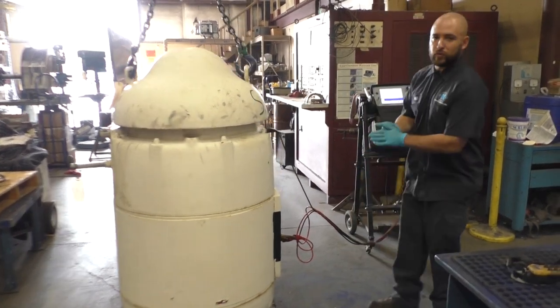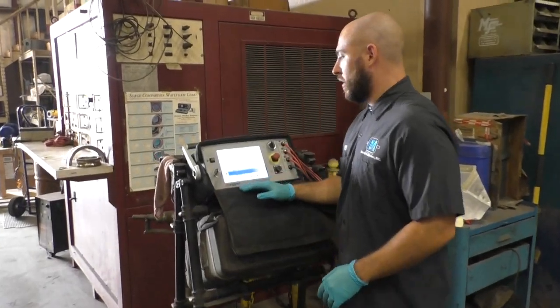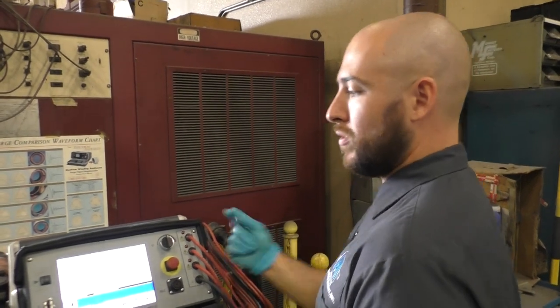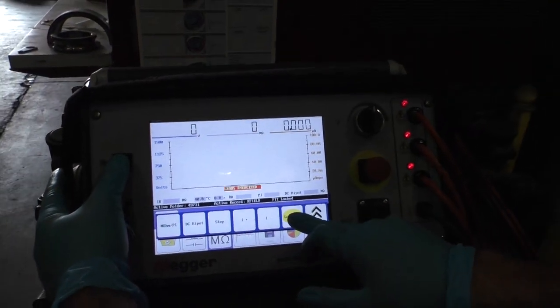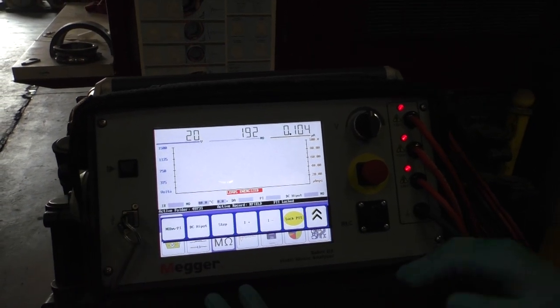Follow me, we're going to begin the high potential test for it. That is going to show if we have any kind of leakage to ground, if there's any shorts, it's going to click us out right away. But if we do not, then we will be able to get this full test in. So I'm gonna lock it so I don't have to have my finger on the button the entire time.